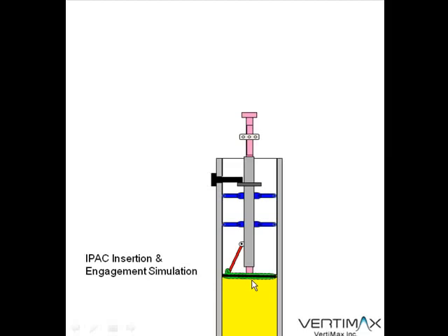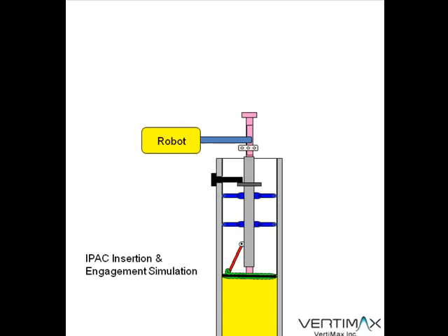If for some reason the valve does not close all the way, there is a mechanical backup where the robots can come in and use this threaded nut type device to extract the center plunger assembly if necessary to fully close the valve.